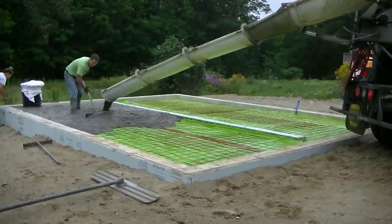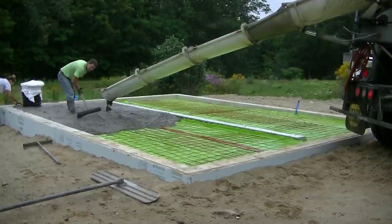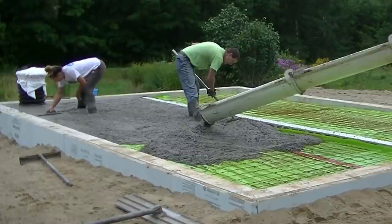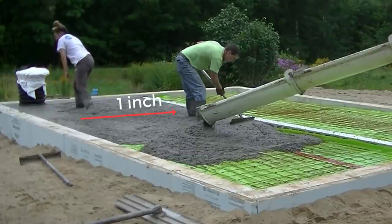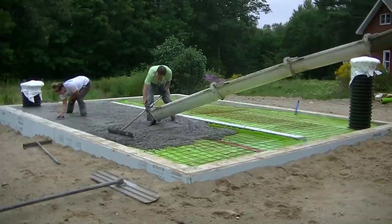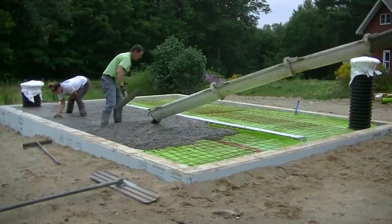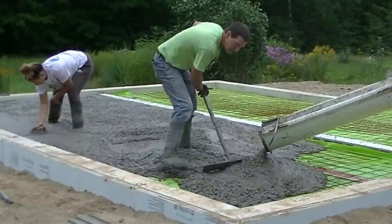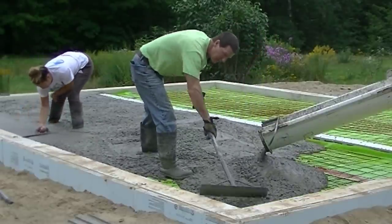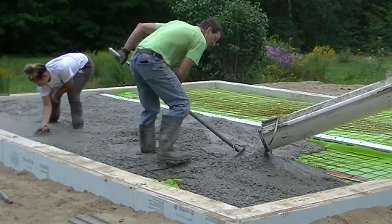Today this is going to be kind of like a greenhouse. That thing you see in the middle of the floor — that's a trench drain. The concrete floor slopes from the outside down towards the trench drain on both sides. Having that trench drain gave me a reference point to screed from and also broke it up into almost like two different little pours. We're pouring one side first, then we'll move the truck over and do the other side.